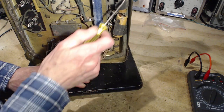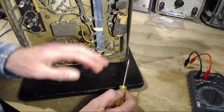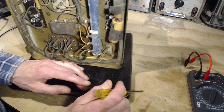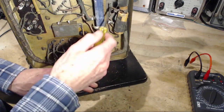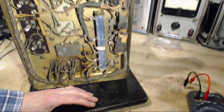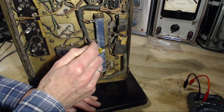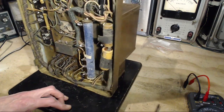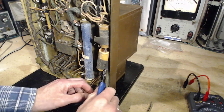Negative side of the capacitor, don't think this one's electrolytic. These two really do appear to be just in parallel. You just parallel two of them, but that only gives them one. Where's the other? So conceivably what's happened here is there's two inside. Somebody concluded one of them is bad, somehow recombobulated things. They needed to use two capacitors in parallel, installed them so they look like they're in series or doing something independent of each other in order to get the appropriate capacitance. I don't know. I mean, the story holds up, but is it true? Could be some more truth to be found here.